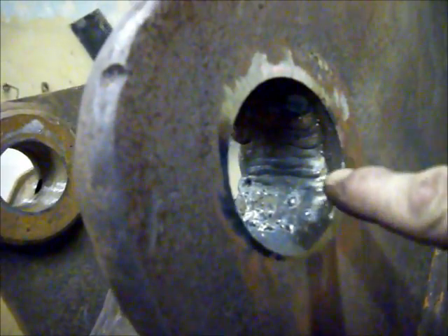I'm welding the hole up and as you can see I'm leaving about a quarter of an inch around through there. I haven't went all the way around yet — I'm leaving the quarter inch for the cones to come up so it'll center up on this hole. These holes weren't as bad as the other holes, that's why I'm leaving that little quarter inch. The weld balls don't have to look pretty because it all comes right back out.